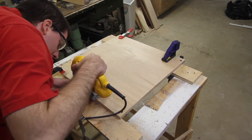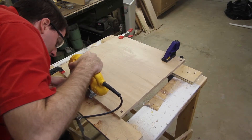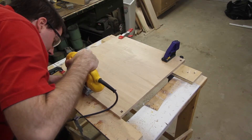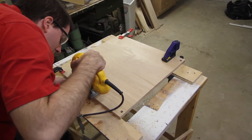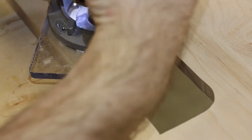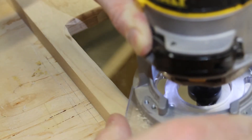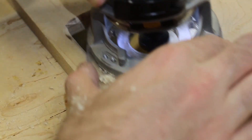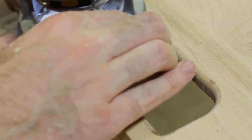I'm going to switch over to my little DeWalt router. It's got a quarter-inch roundover bit in it. My problem here is two-fold though: my bit is fairly dull, so you can see that it does burn the wood a little bit, and also the bearing on the bottom of it is very large, so it doesn't get into the corners.